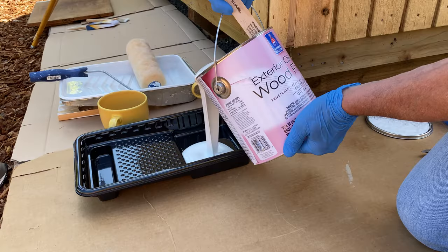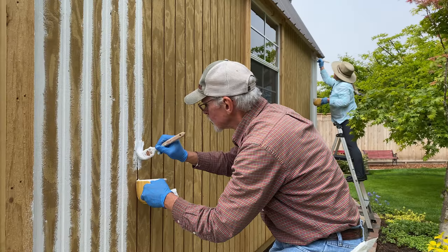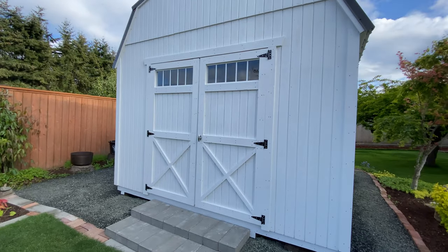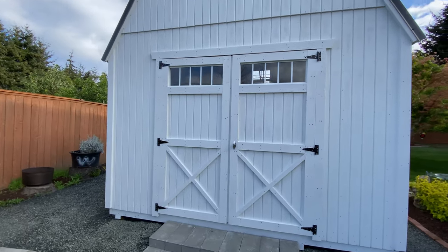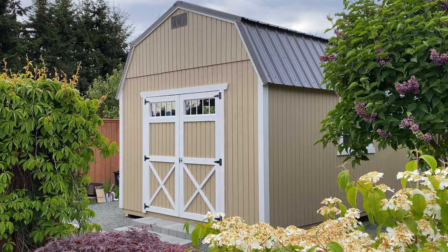After the caulk has thoroughly dried, we will paint all wood surfaces with a good quality oil-based primer. The shed will then be thoroughly prepped for applying a top brand of latex exterior paint that matches the colors of paint used on our house's T111 siding and trim boards.